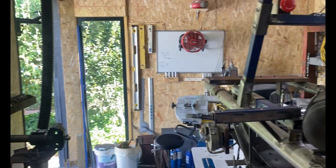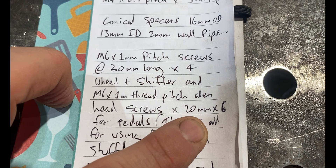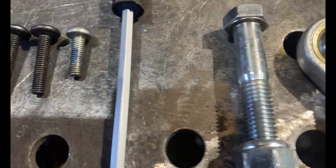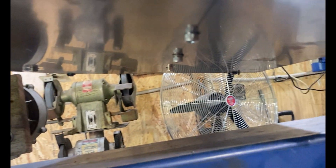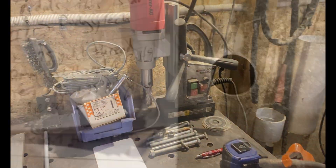You'll also need six of the same size M6 one millimeter thread pitch, but at 20 millimeters long - that shorter one - for your Logitech pedal board. They're shorter so you don't bottom out in your pedal board, so they've got to be 20 millimeters in length.